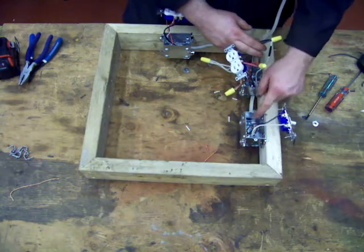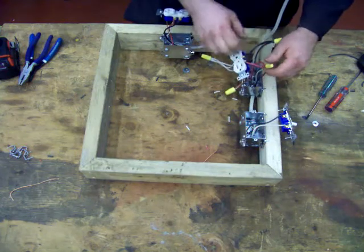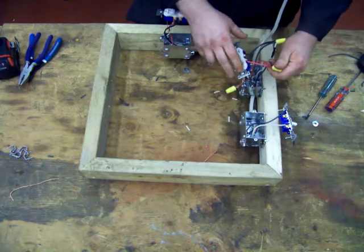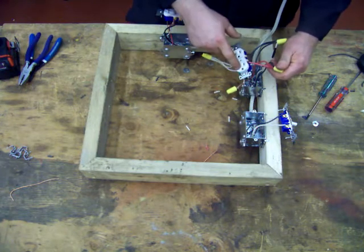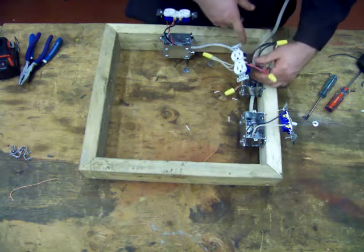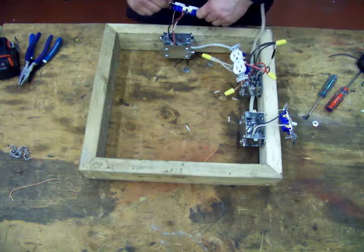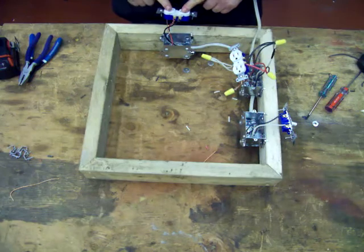Hot comes back down to the box, into here, up this wire, to this pigtail. And we have power going to this receptacle on this side with the tab broken off, so this is good. This will be switched, this will be on, and we send power through this wire to this receptacle where it is on this side as well. On all the time, switched.